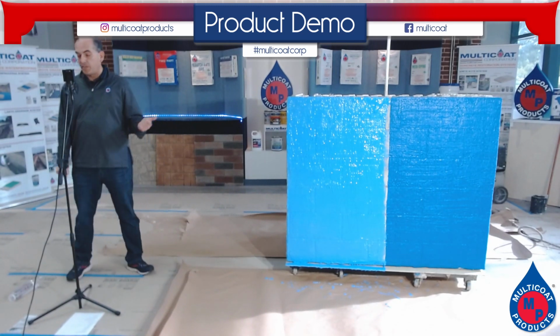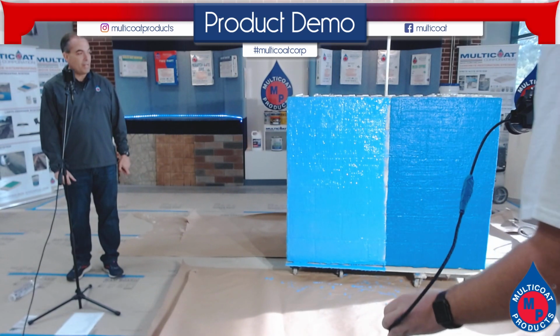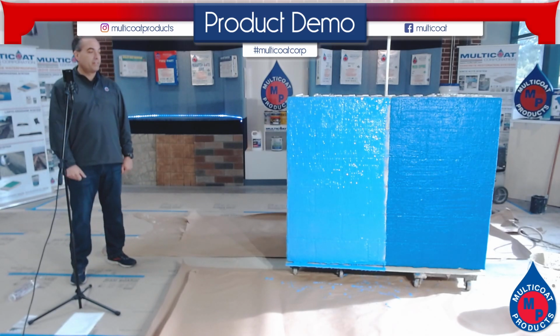For our BG, you don't require any protection board, but for our Multicoat premium system, we specify our scratch coat to be put on as a protection coat. The Multicoat's more elastic, but it's a little more sensitive than the BG. BG is like a tougher product.